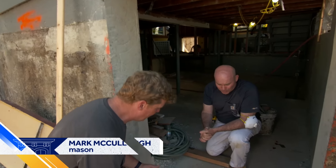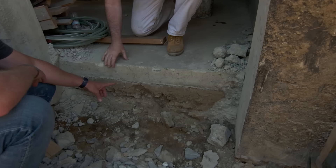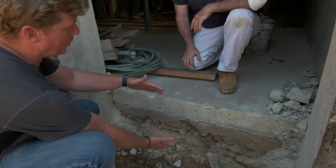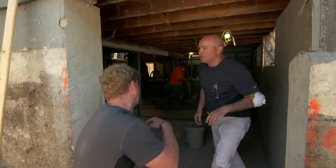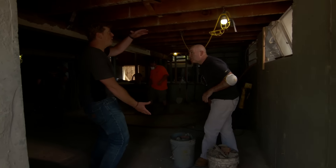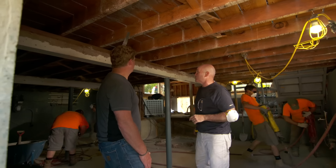12 or a little bit more. Cut that away, but you've also got to do something with the floor? So we do have a height problem, so this floor has to come out, and once it comes out, we're going to dig down another seven or eight inches. So you've taken out a total of almost a foot here? Almost a foot, yeah. And that's not to get it even with the garage — you actually want to pick up some head height. Richard and I were in here a few weeks ago and had to kind of duck. What do we have right now? You're a little under six and a half feet right now, which is not enough to really function in the room.